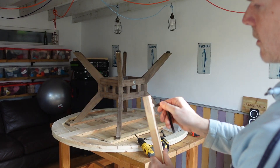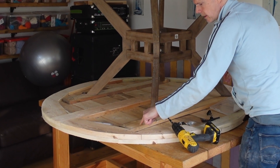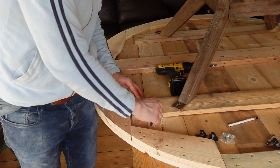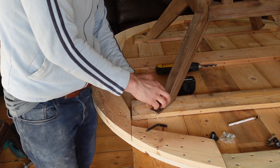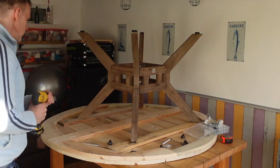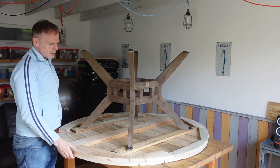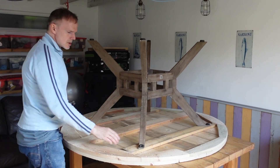I'll do it so it's flush — so let's do it on the real bit. I've marked exactly where I want to drill. I'm using a 10mm drill here, and then the furniture screw fittings will go in. Let's do that up so it's flush with the bit of wood. Let's just test it out — that goes there, that then screws into there. It works — let's try it on all the others. Solid. What we need to consider is that people will pick up the table and the legs have got to stay on, but even picking it up by the legs should be fine as well.